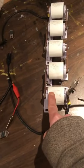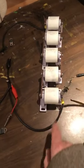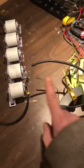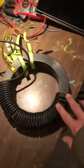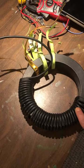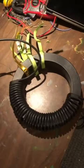So we have a 5,000 volt artificial ground reference oscillating between zero and minus 5,000 volts on the second earth ground wire at the end of the primary step-down coil. If we have 5,000 volts in here and we're jumping — in this situation it's 4,000 — so we have 4,000 volts at four microfarads and we're going to arc that to ground. We'll actually see a potential difference of 9,000 volts: 4,000 volts here and minus 5,000 volts as the ground reference, and that gets arced out to ground.